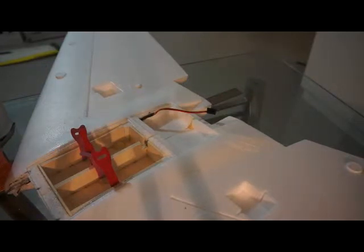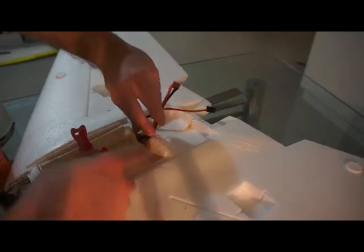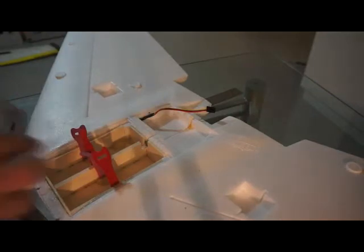And this is a cable you will need to make by yourself. It's pretty easy to do. You just take two Deans and solder them together, and then use a small cable with the Deans on the other end, and this will then in the end sit in here like this, so that you can plug in the batteries on both sides. I've already finished this right now, but it's better to attach the last Deans plug at the end, so you can cleanly run the cable through. And then after you ran it through, you attach this Deans plug.